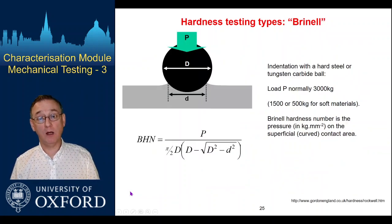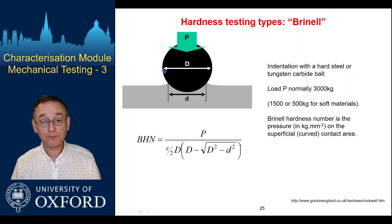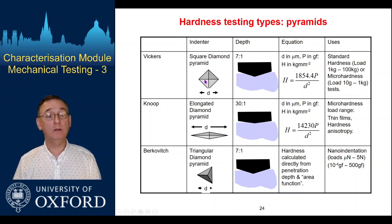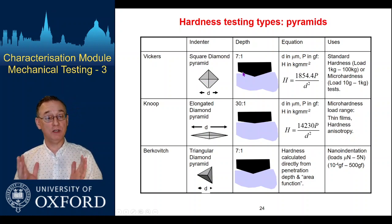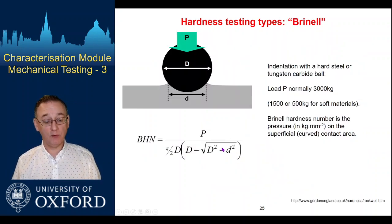Okay, as I say, these are the pyramidal ones, but there are all sorts of other shapes you could use. The other very common shape is a sphere. This is rather different in how things work — with conical or pyramidal shapes, the indent impression is self-similar, meaning there's a fixed ratio between the lateral dimension and how far you've gone into the material. With a sphere, we always get a circular impression, but we no longer have a linear relationship between the lateral dimension and the depth penetrated into the material. So it's not self-similar anymore.